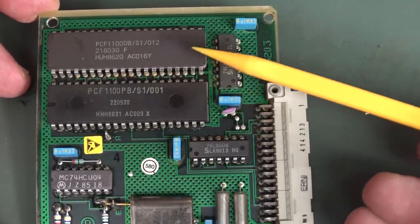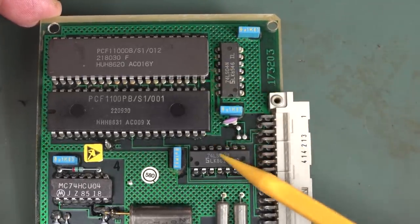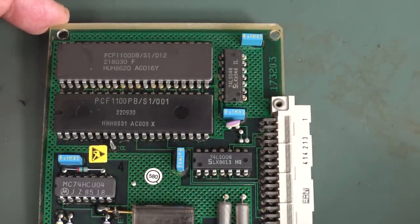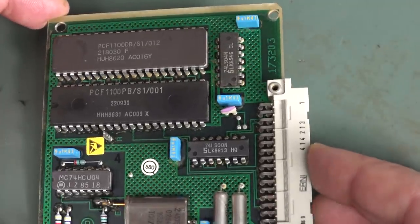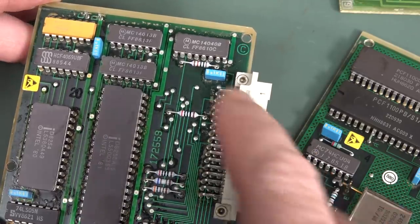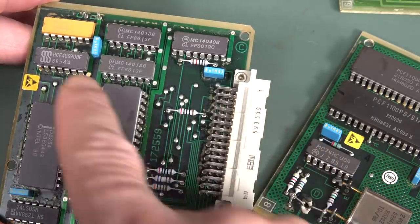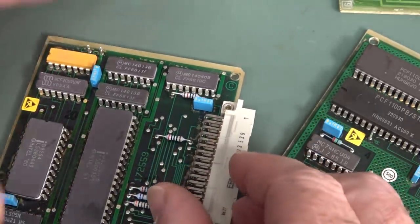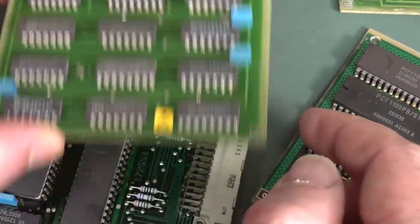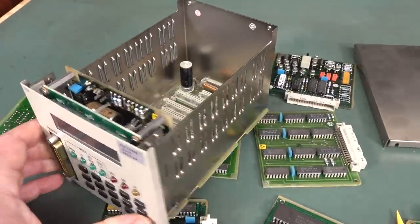So they're doing something that requires a lot of gate array action. I mean, these won't be big gate arrays, I don't think, not like large PLD type stuff. But maybe they're processing some serial data or something like that, perhaps. I don't know, 7400 there. That's like, meh. Anyway, I was right about the date on this. We've got 86, there's 88. Most of it's 86. Is that even? Yeah, it looks like 88. Everything else seems to be like 86, 85, something like that. So anyway, it's mid to late 80s vintage, which is what you would guess.